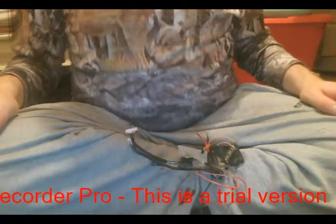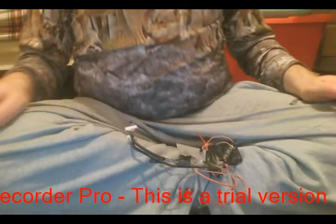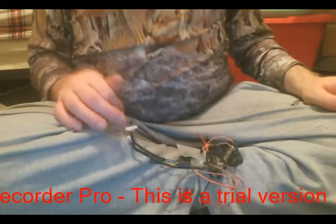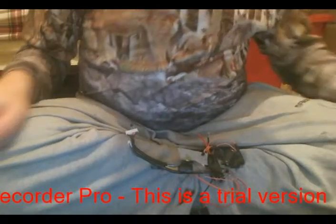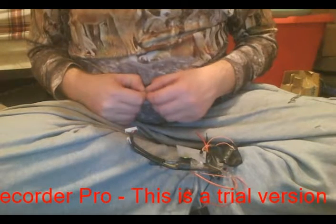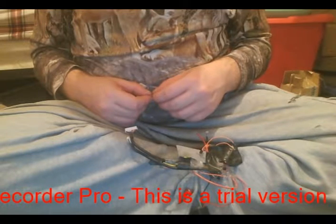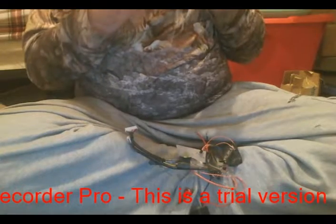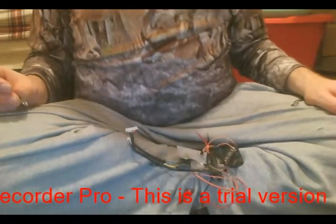That's why there's two lights flashing, because there's one that's for one type of transistor and the other one's for the other type of transistor, and both have a transistor in its socket, so it's running. So if I take this transistor out, you see the green one stopped. So this one must be a PNP. And it is. What will happen if I reverse the emitter and collector?